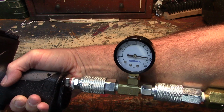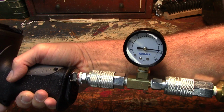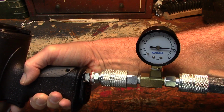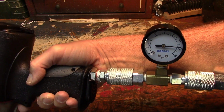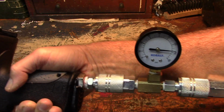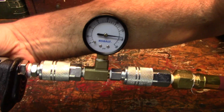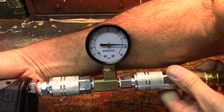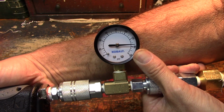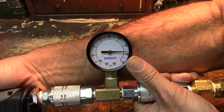Instead of listening to the air compressor rattle, I just cut the tape for a second. I turned on the second tank now, so now I'm at, again, full power with the auxiliary tank on, so I'll be pushing 30 gallons of air. You'll see it's a little bit better this way. About 138, 135 line pressure right now, and you got to run it at 90 for full power. Here we go.